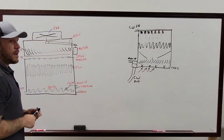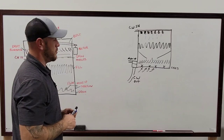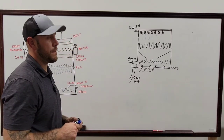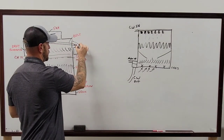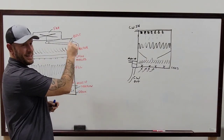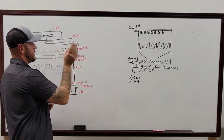Also that shroud that covers the pulley will be dragging on that pulley. Yeah, but the shroud itself is sometimes loose and that can throw the vibration readings off. A lot of the times you're talking about the little, kind of like a door. Yeah, exactly. It covers up the whole thing. Most of the time you'll want to take that off of there.